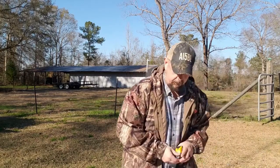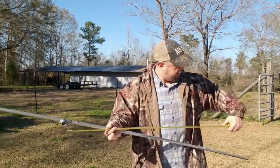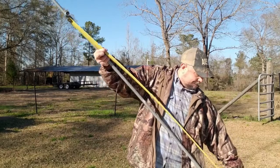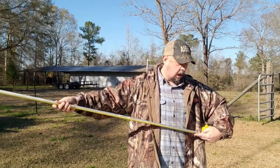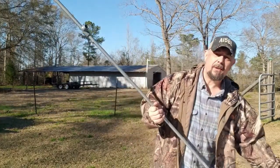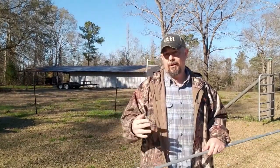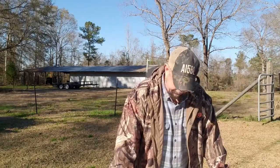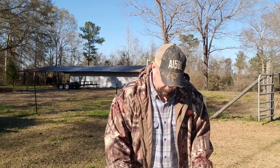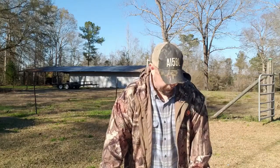From the top of this connector to the end of this thing here is 146 centimeters. I use the metric system even though I'm a redneck, because it seems like it's smaller increments and it's just easier to measure. So it's 146 to the top of this, which is where our little stub is going to go — we're going to put our tuning stub there.